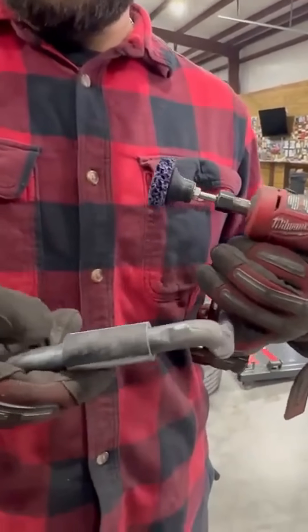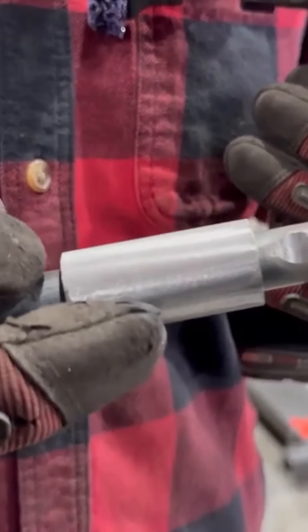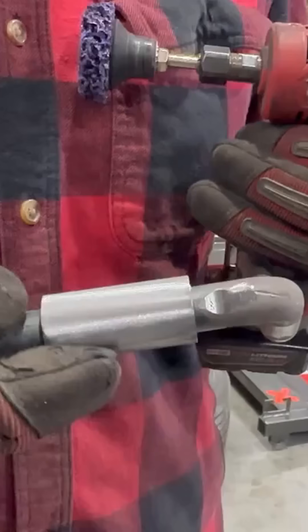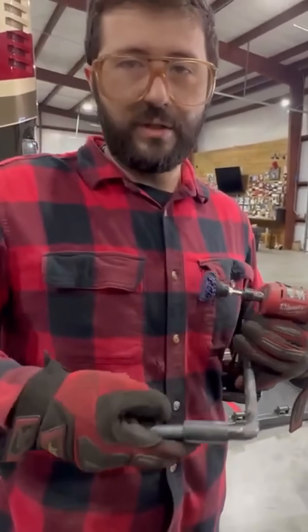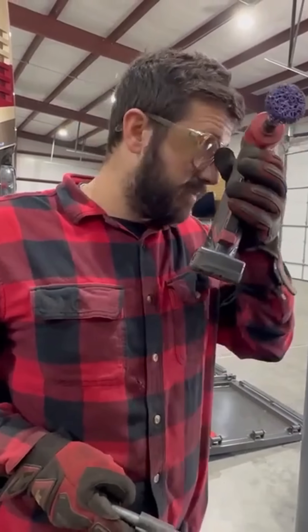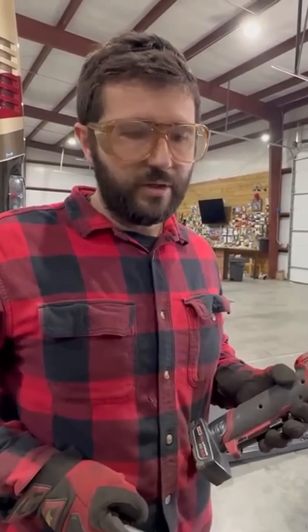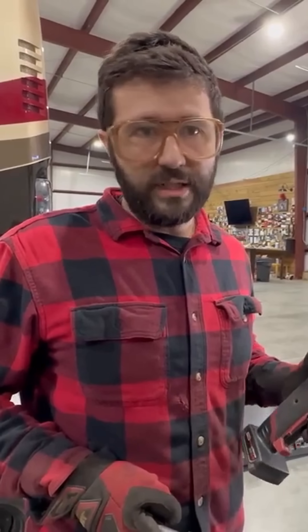That's not actually workable metal you're looking at — the bright silver is. So I'm taking the coating off so you don't have impurities in your weld, which makes it weak. You'll notice porous welds whenever somebody didn't prep well before they started welding.